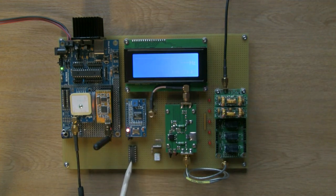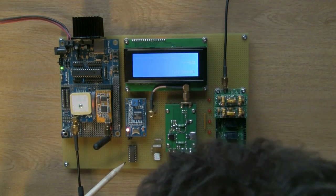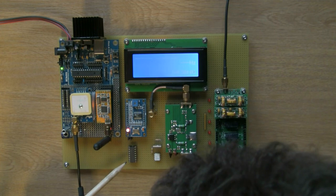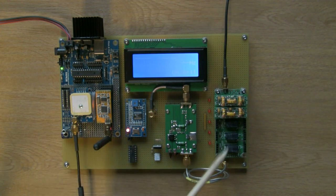Oh, this chip down here, probably not completely necessary. This is a 7-channel Darlington driver device. God, I can't remember the number now. Hang on, two ticks. ULN2003A. Yeah, sorry. So it's like seven little Darlington drivers, and I'm using those to drive the relays.